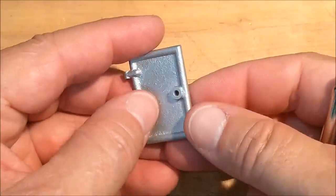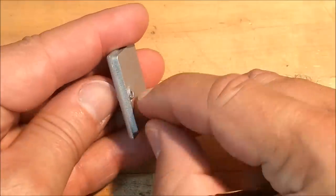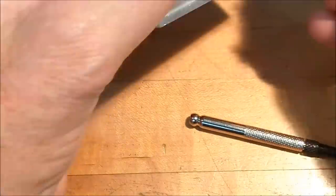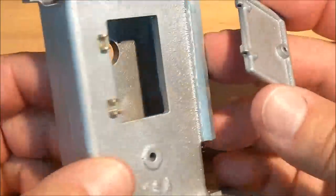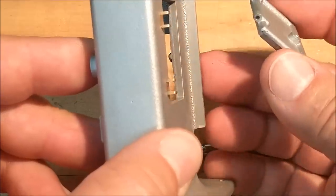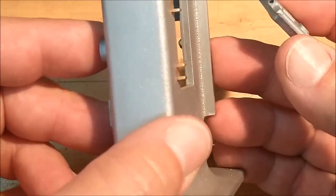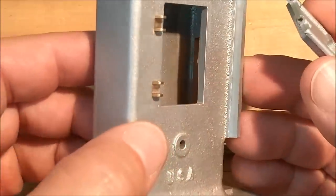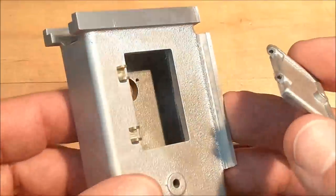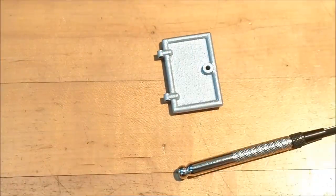Door handle's no big deal. It's going to be a little scallop knob, like the clutch knob on the mini lathe. It's going to go through, and it's going to have a little dog on the back that engages the frame and keeps the door closed. And that little bump right in there that you can see right by my finger, that's where the little dog is going to stop and keep the handle from rotating all the way. If you want to, you can get creative and knurl that part, bend it a little bit, and it'll cam and lock tight if you want it to do that. But we'll just see, come up with some numbers and get over to the lathe and make this happen. Let's do it.